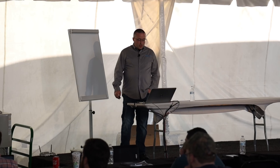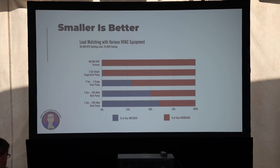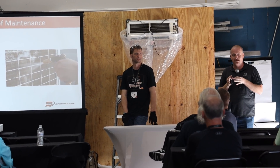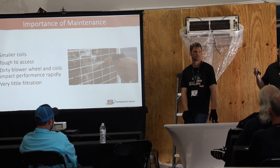The question you always have to ask is, can you cover the middle? Let's look at a couple different pieces of equipment. Let's pretend we're going to do a single stage heat pump that puts out three tons all the time — like a hyper heat or something like that. The condenser coils are smaller, which means that if you don't have a really clear strategy for maintaining ductless, if you're installing ductless, you're going to get into trouble — meaning you're going to have unhappy customers.